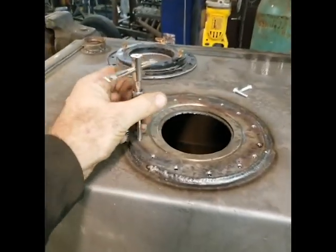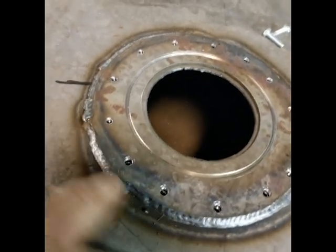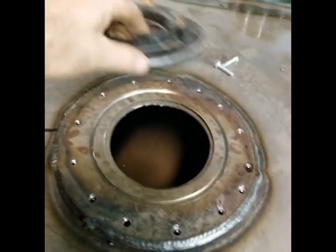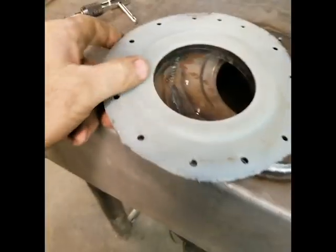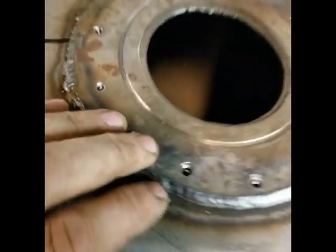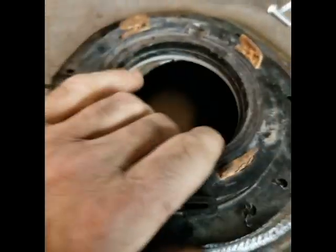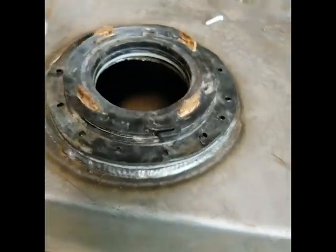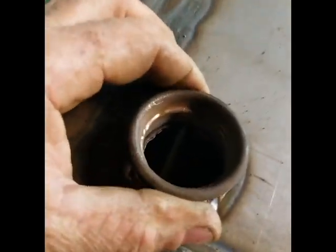I've made the top and welded it in. I don't really have a way to pressure test it now, so I'm just gonna seal this up. This sending unit ring is out of a GM pickup truck — I just cut it out of the truck. There's a groove in there, so my plan is to put an o-ring on there. I put it through the lathe and cut a small groove around it. I put my gas filler in there — it should sit tight and seal tight.